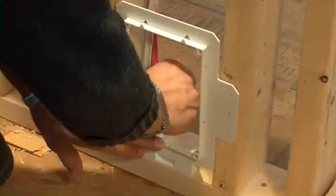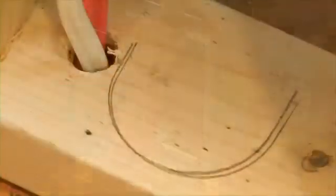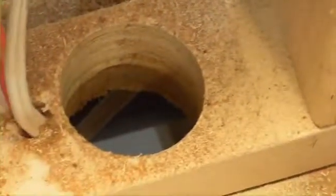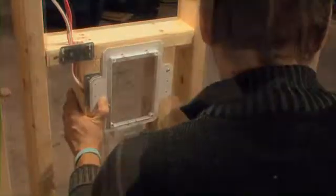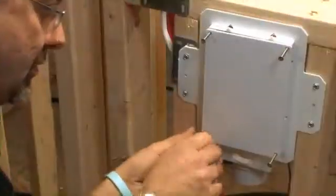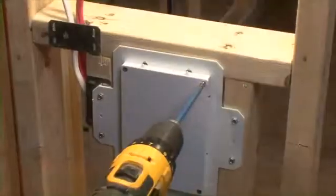The inlet mounting plate rightly serves as a template for determining the width of the support and the floor hole. If you haven't already marked and drilled, then screw on the inlet mounting plate, its bottom 36 inches high. You can then pull in 12 inches of slack wire in the inlet. This slack is necessary for the electrical connection. Screw in the back plate. Next, glue a section of special air PVC pipe long enough to help piping the underneath floor.